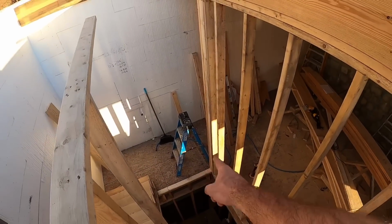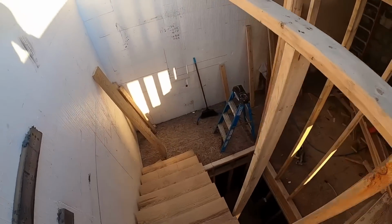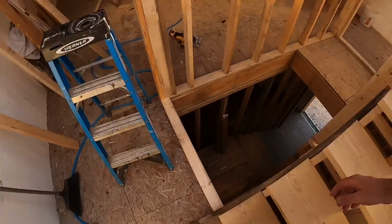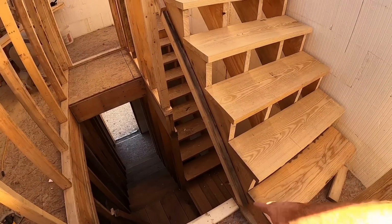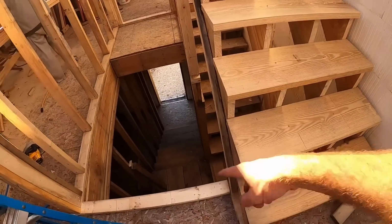Well, there you have it. We redid the framing there and got that corner started. We got this center wall started. We got to come down here, put us a small block there, bring a header across onto a small block that feeds into, I gotta figure that one out. Not for sure how that's gonna tie together, but that's all right.